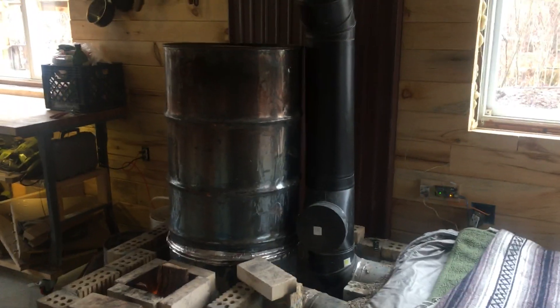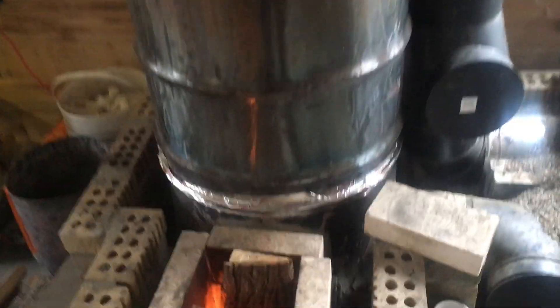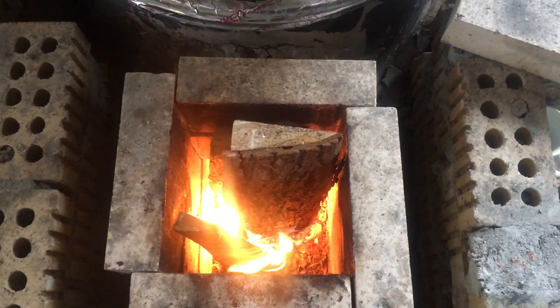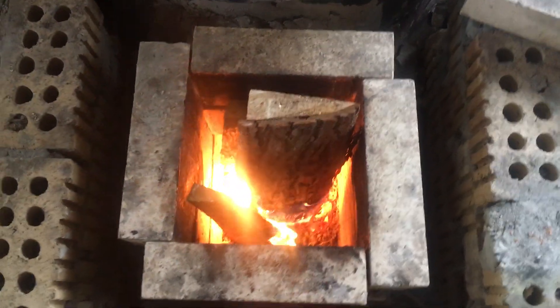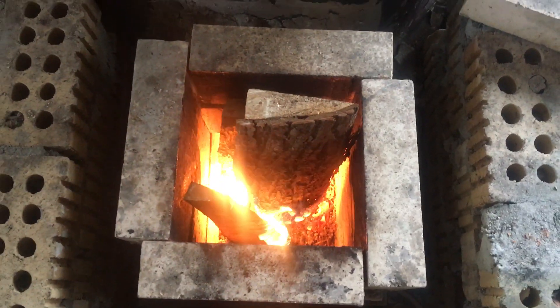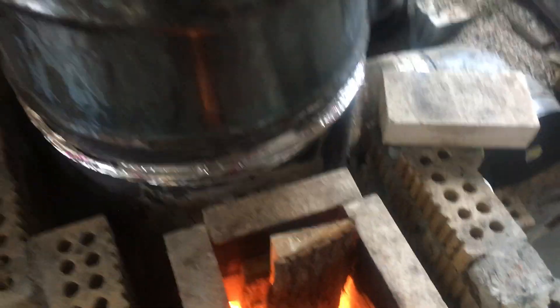Going great — super awesome performance. I did the annual clean yesterday. I didn't take any pictures or do any documentation, but it took about 45 minutes to take the barrel off and clean up mostly just some fly ash from down low in the barrel and on the lip — the way it's designed to catch all of that. I was really surprised: there's no black soot. It was very brown, burned-up-looking stuff that came out of there, which was impressive and cool.